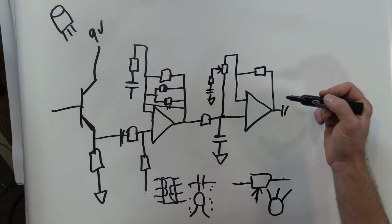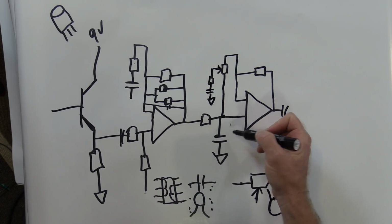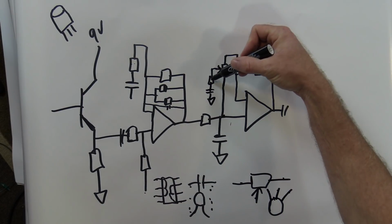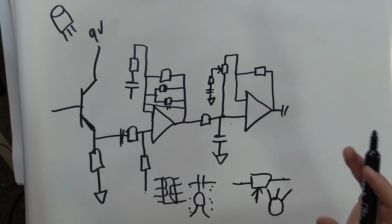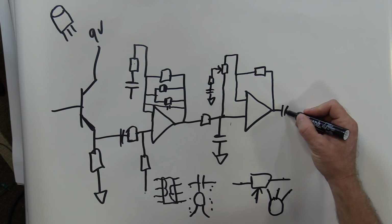Pretty fancy. What that does is whenever you turn the tone control down, it gives you another low pass filter and doesn't do a whole lot on the boosting side. But whenever you turn it up, it uses that resistor and capacitor going to ground to create more gain or volume, but the values are situated such that it's gonna mainly boost highs, and it's not going to do as much filtering to ground because of that resistance of the pot. So it's kind of a fancy little deal there. Pretty unique for the time.